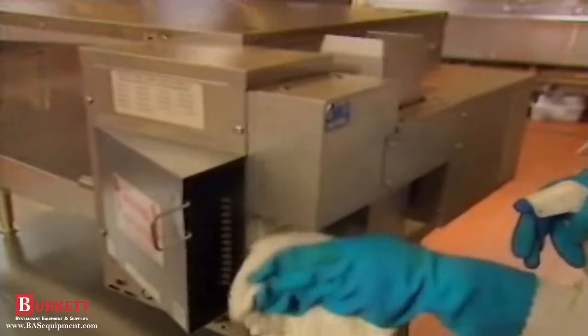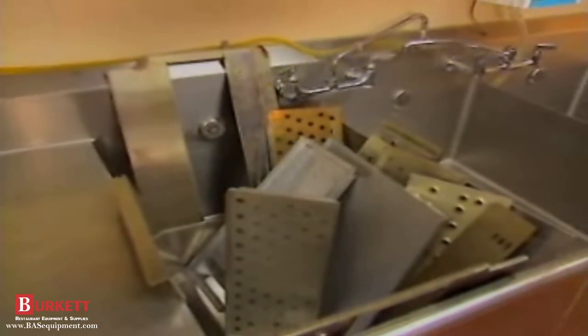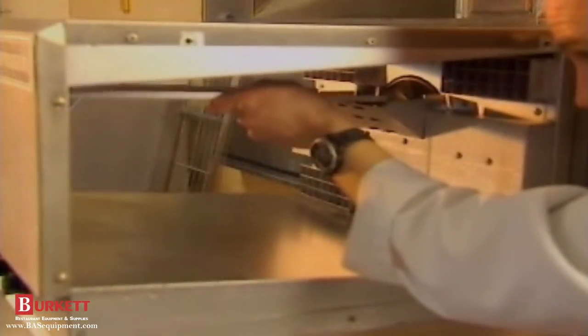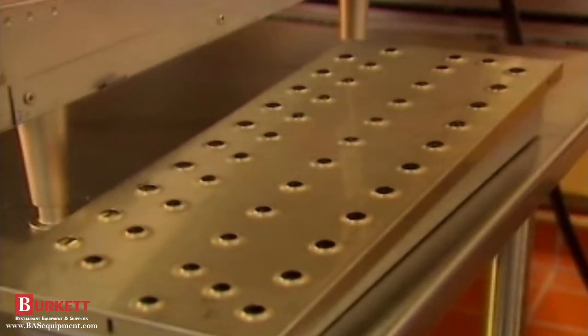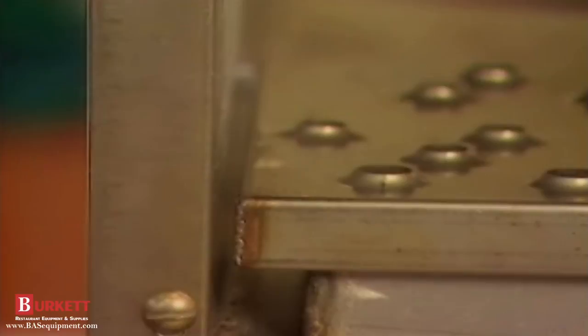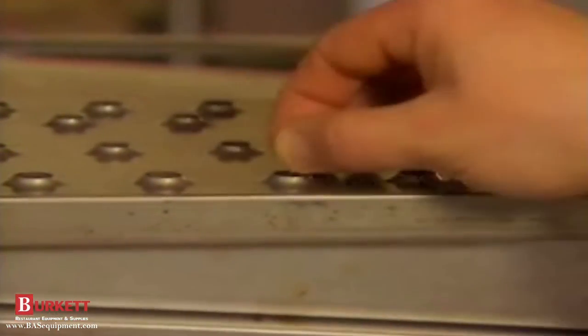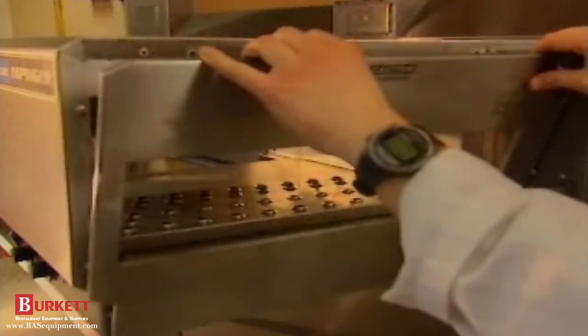Clean all the vents and louvers that are on the right hand and rear of the oven. The parts you washed should be dry by now, so let's reinstall the air return baffles and put the fingers back together. Reinstall the top and bottom air return baffles in the proper locations. With the outside metal lip facing up, nest the columnating plate securely inside the finger housing with the small notch toward the narrow end of the finger housing. Slide the cover over the finger. Now we can reinstall the fingers. Make sure the top finger housings are fully seated around the plenum flanges and secured in the front on the hanger. The bottom finger housing should be about a quarter of an inch away from the front wall of the oven. Make sure the holes in the columnating plates align with the holes in the finger covers — the air jet holes must point toward the conveyor. Reinstall the end panels by lowering onto the retaining clips. Push the panels tight against the oven cavity and turn the quarter fasteners.